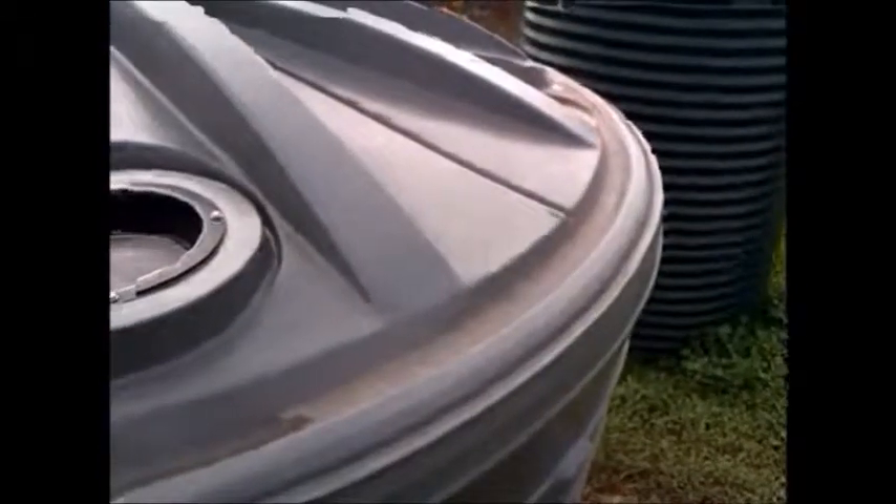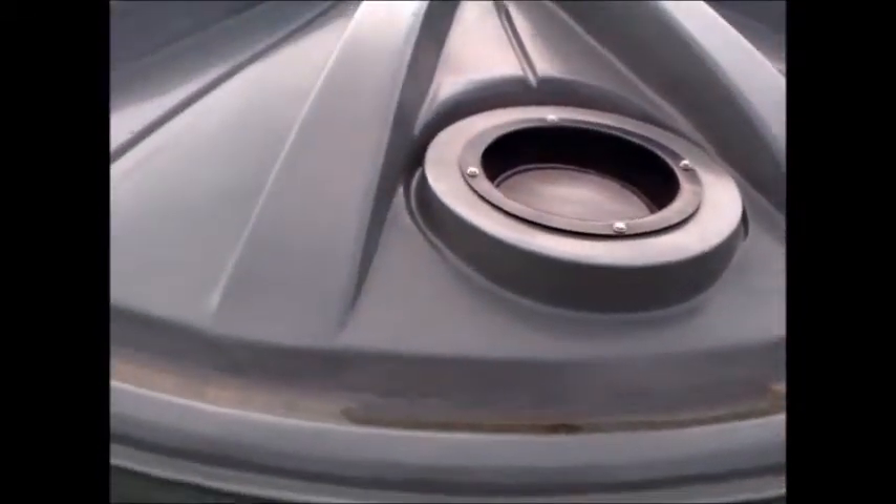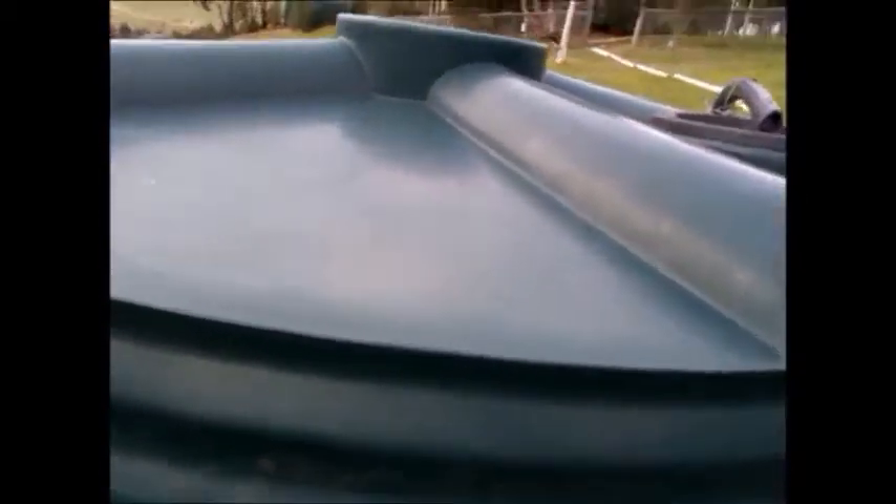Over time the grass roots will grow into the base. We selected this tank because it's got a nice gutter or groove around the edges with a few holes along it — you're able to trap run-off from the roof, so additional water is captured in the tank. If you compare it with the other tank sitting beside it, when water falls on that tank's roof it just runs off onto the ground.